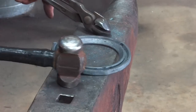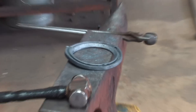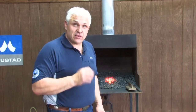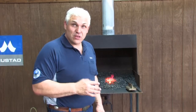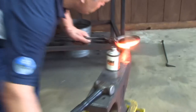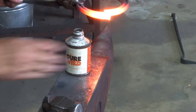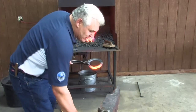We've got half the shoe made. Now we've got the shoe made and it's ready for welding. In the welding process, I'm going to weld it, shape the back of the bar, fuller it, and try to get most of it done in one welding heat. I'll have a second welding heat just to finish the weld and to rasp up the back half of the shoe. I don't put the flux on until my shoe is hot — clean the weld off, flux it, then come back to the fire.